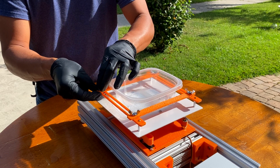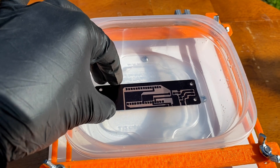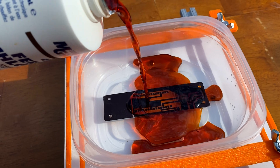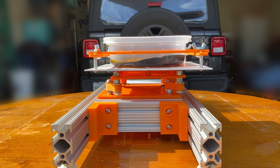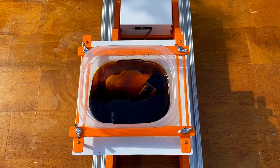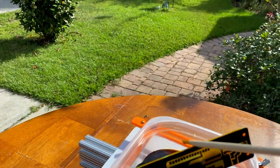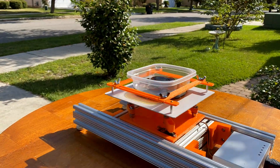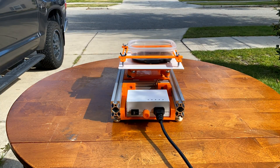You could also agitate the materials manually, or in this case automatically, to speed up the etching process more. Just pour a small amount of ferric chloride solution just to cover the printed circuit board. After several minutes, check if all the exposed coppers are removed. As this is double sided, the back side is not fully etched yet. After a few minutes more, I washed off the marker and cleaned dry.